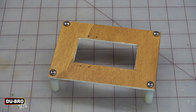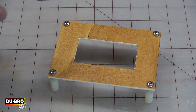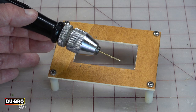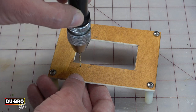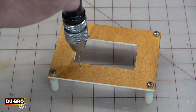Now we're going to drill the pilot holes for the mounting screws. You want the diameter of these holes to be a little bit smaller than the diameter of the screws. In this case I'll be using a 1/16-inch drill bit. When drilling into light ply, I prefer to use a hand-powered pin vise rather than a power drill. Line up the drill bit on your mark, give it a little push down to keep it from walking as you get started, and then drill your hole.